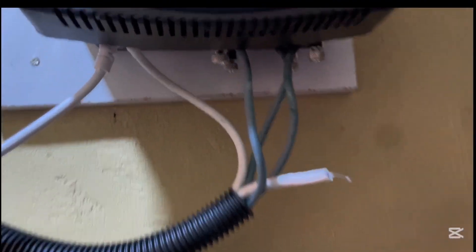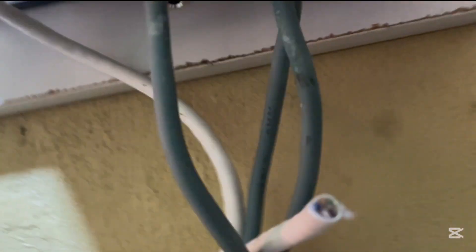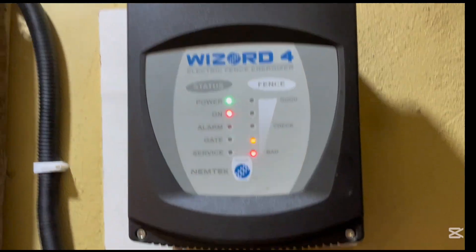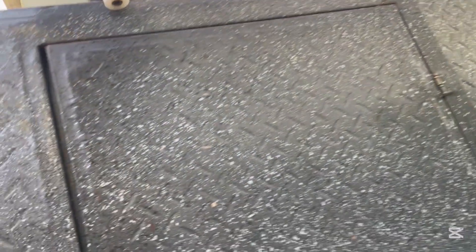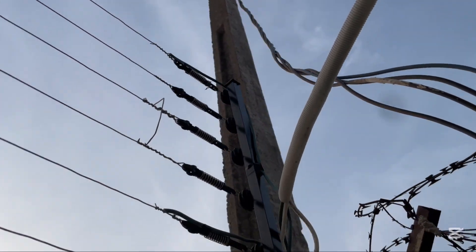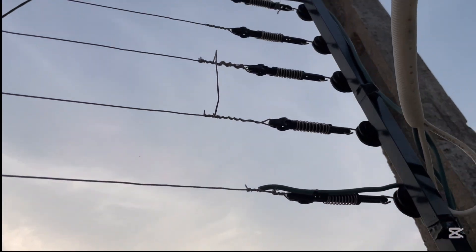This is the correction to the previous errors. Now you see just a single feed from here — the live out and the live return cable. That other cable that was used earlier I had to cut off from the system. I triggered the alarm to test it — it's fine now. Let's go outside and see what we have there. Let's turn it off and take a look at the connections. Now you can see the cable from the energizer came from here over to here — we only have one cable on line one, one on the earth which is on line five.